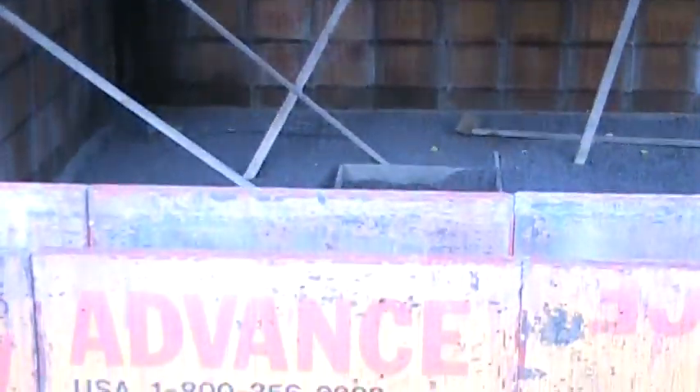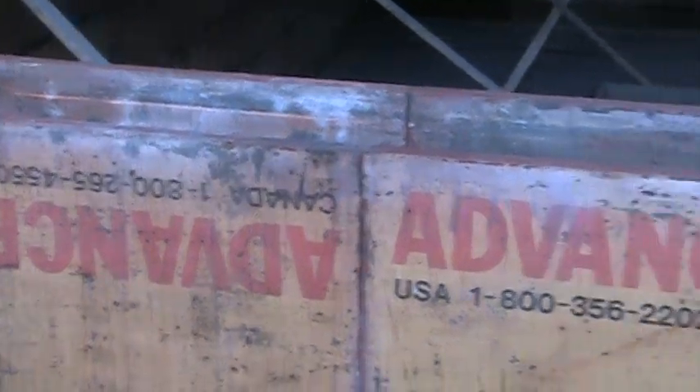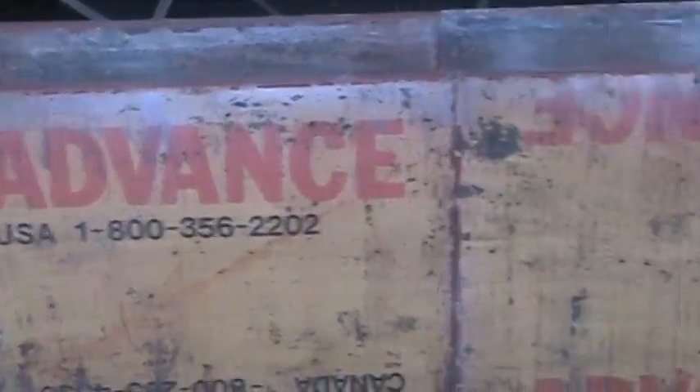The new beams are going to be located in the same place as the old beams, and they're going to rest here. But I've got window openings right next to them, so I have some extra thick rebars in that area.